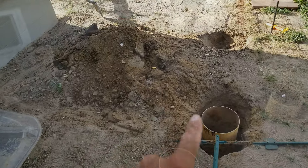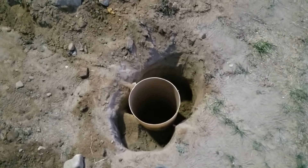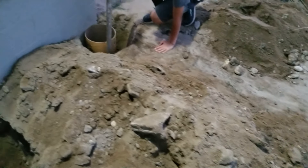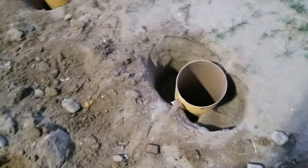Foundations for entry stairs are important because they provide support for the heavy vertical loads and will also keep your stairs from sinking, sagging, or pulling away from your house. For my stairs I chose to go with a pier foundation. These are 10-inch concrete building form tubes and I placed one in each corner of where the staircase footprint will be located.